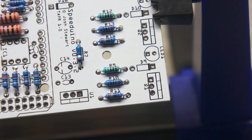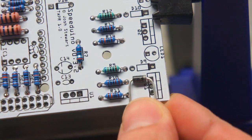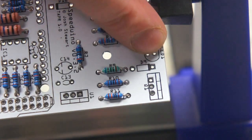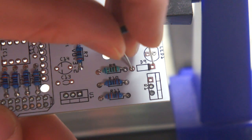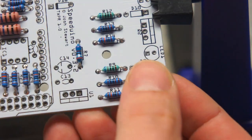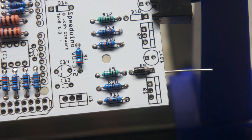That gray bar corresponds with the bar or marking on the PCB, so do make sure that you get these in the right way as putting them in the wrong way will cause all sorts of problems. To give an example of the way they should fit, you can see on this diode that the gray bar is on the right hand side and this aligns with the bar marking on the right hand side on the PCB. So again we fit that in the same way and then solder up from behind.